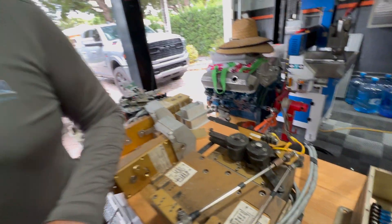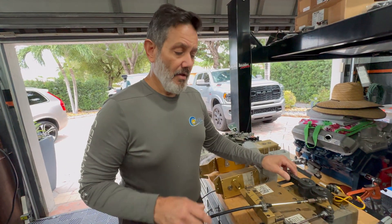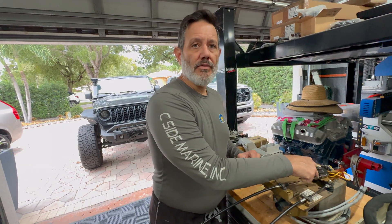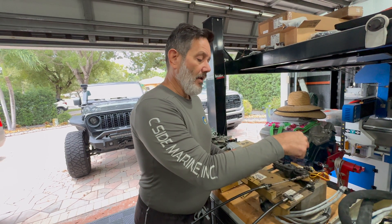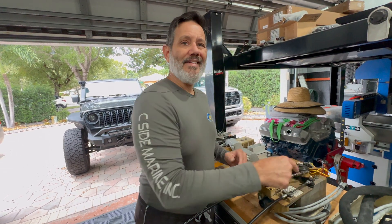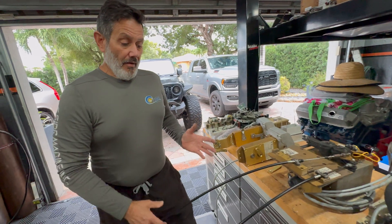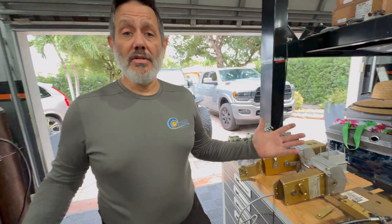That's my suggestion — it's a little bit of insurance for all the boat owners out there. Make sure the throttle cables, the governor, and the arms on the governor move nice and free. Make sure the transmission arms move nice and free. If there's any resistance, it's going to fall back onto the actuator, and if the actuator doesn't work, it'll fall back on the mechanical backup. If you have any questions, hit us up on our webpage. Like and subscribe!